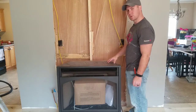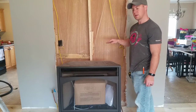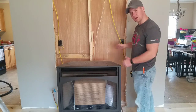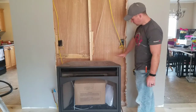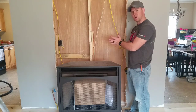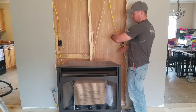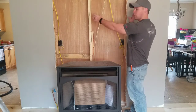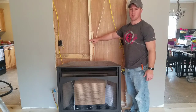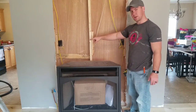What I've got to do here is put a stud here and a stud there. Then I've got to put what's called a jack stud. The outside first stud will be called the king stud. Then I'll put a jack stud inside the king stud to whatever height the bottom of my header will go. Then my header will be a doubled-up piece — I'll probably use a 2x6 — doubled up and we'll set it right on top of the 2x4. Once that's on there, I'll put another jack set on top and complete the wall, then cut this out.